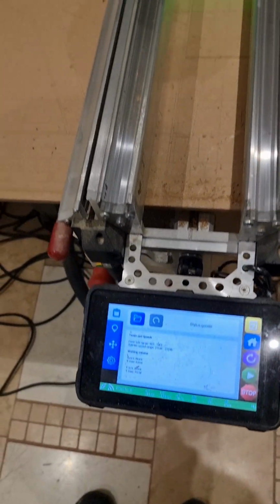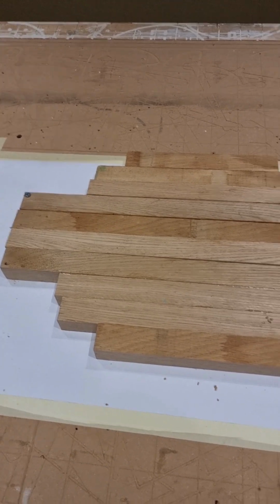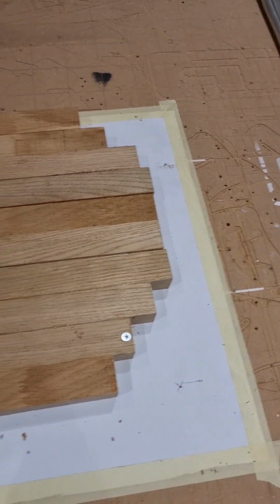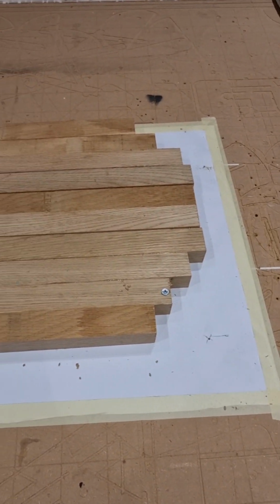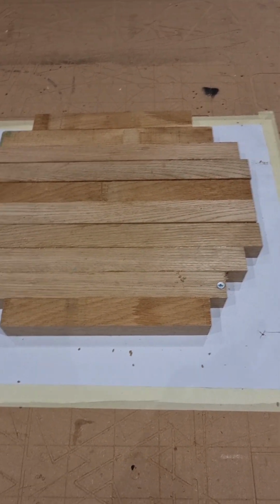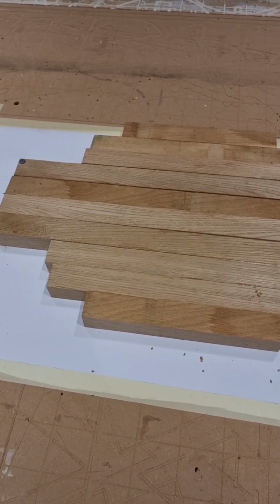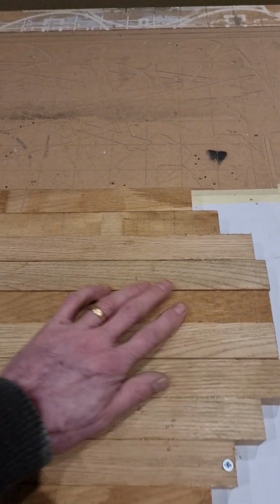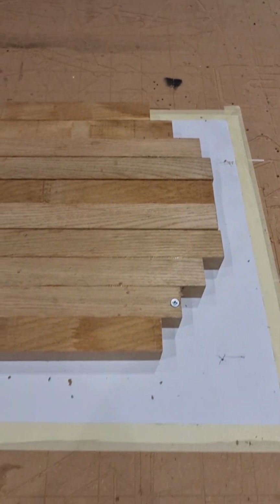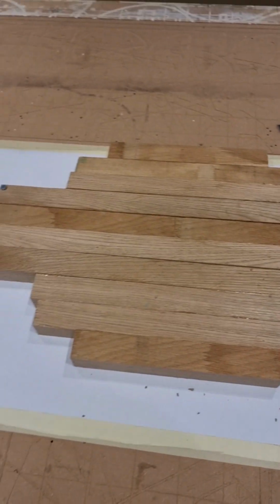Yep, did it wonderful. Okay, so I put the wood blank over the top of it and just fixed it temporarily with a couple of screws just so that I can fix it from underneath, because when I'm doing my roughing toolpath I just don't want to catch any screws or anything, so I'm going to fix it from underneath, and a couple of holes underneath we can fill later on. It's going to be the underside of the board anyway. This will be the top side of the board when we finish. This will be lovely and smooth, and it will all be cut exactly as we want.